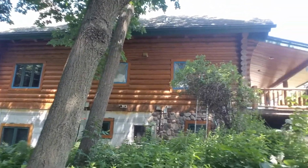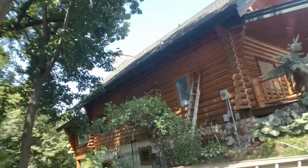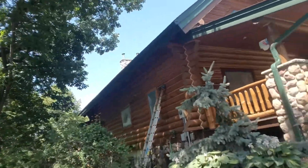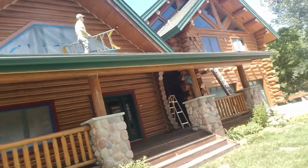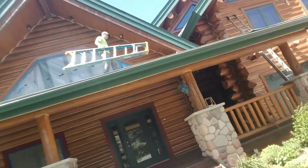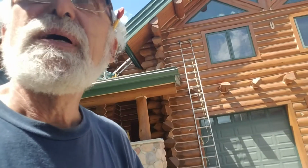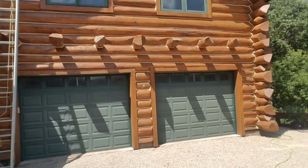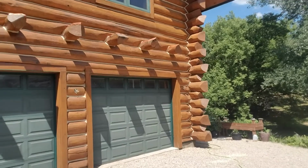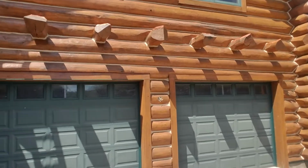we found a bunch of rot on some of the logs on the front of the garage over here, and we're gonna take the chimney repair budget and put it towards the log repairs. When we were here before, we found some decay and we put some boron rods in the areas and we sealed them up good, and we covered them with some copper flashing.